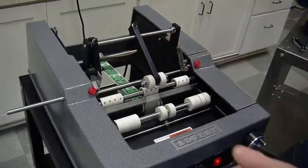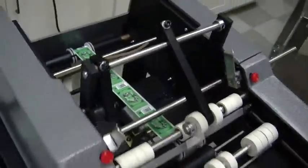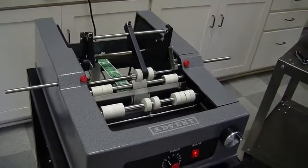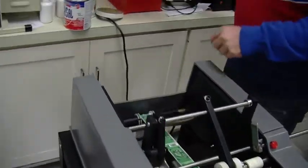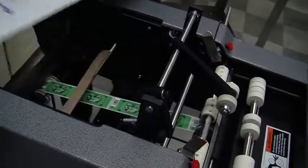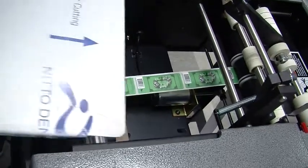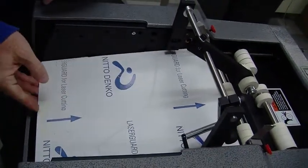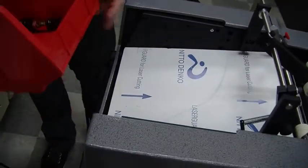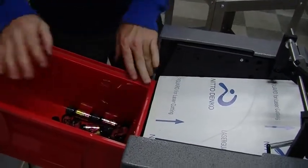Okay. So I'll reattach the spring here. Now if you're doing a larger diameter container, you could probably take that spring out. It doesn't need to be there. Let me get the roll-out plate. We'll put that back into position. Oh, and just to show you how that's how the labels are fed through again. So everything's been set up. Should take you less than probably about 5 minutes to do a changeover. I'll put this here. Okay, it just hooks on.